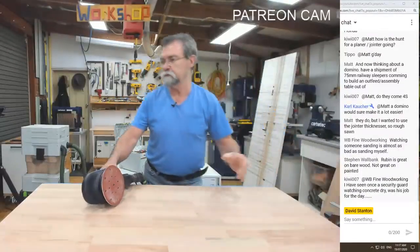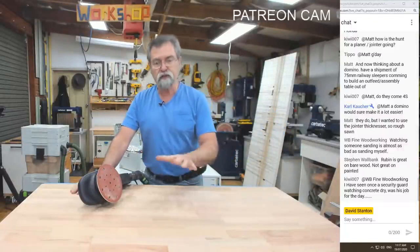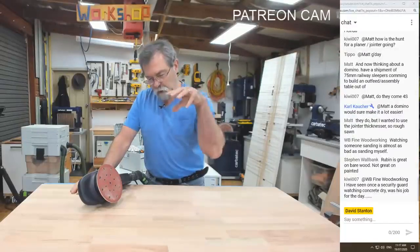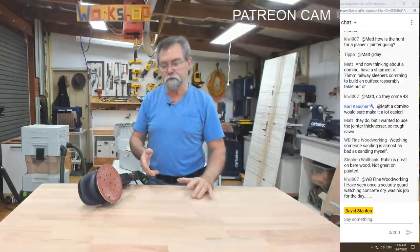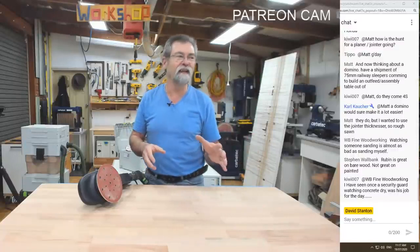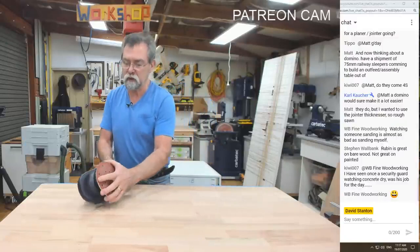If I was using a conventional flooring wax like Whittle wax or Osmo oil, I'd stop at 120. Maybe I could go 180 if I wanted to. But those products are designed to go in, so all of the fiber, it'll suck it all the way in. With the Liberon, it's a different situation. It will penetrate. It takes a long, long time to dry, and it works very well.